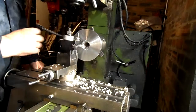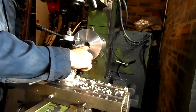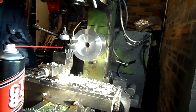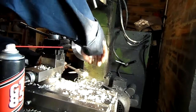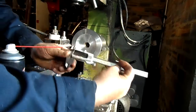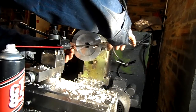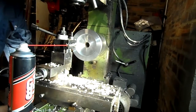I've got the bronze bush in there and I've still to bore the bush to its final size. I'll do that after I take the rest of the counterbores out. I'm roughing out for a 13.6mm bore by 106.4mm wide. It's showing minus 5.08 — that's a fault that occurs on these — so I'll just need to zero it again. Claims to be 106.3mm.